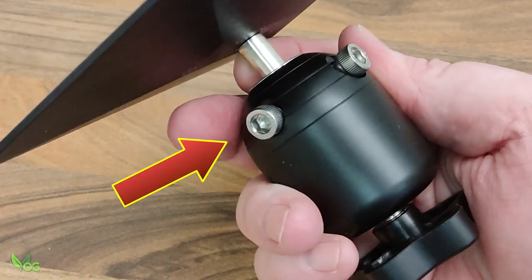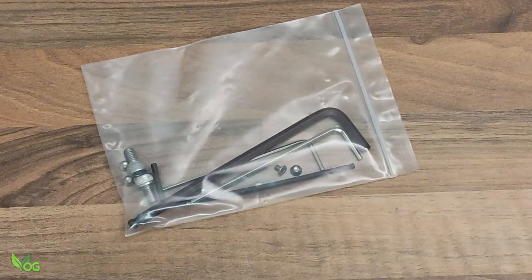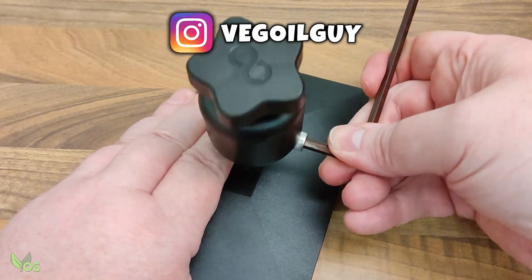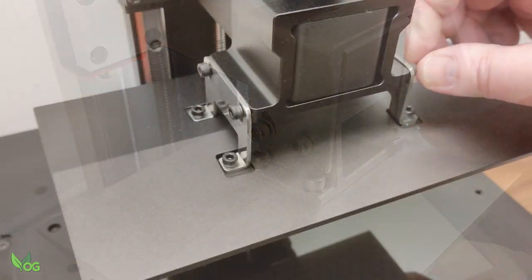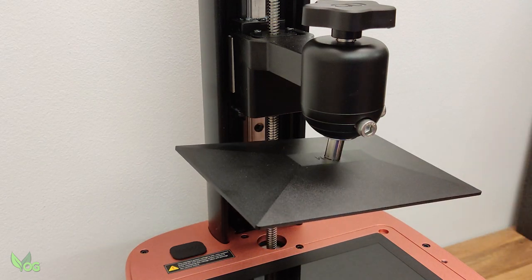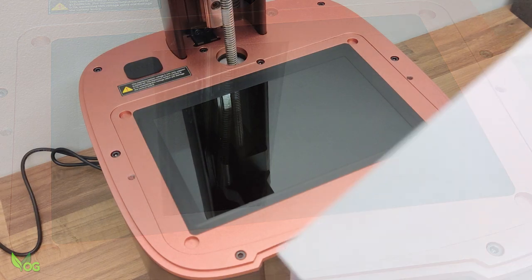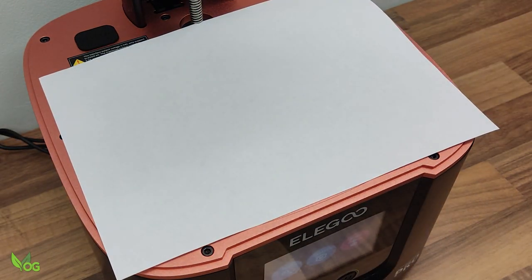To level it, the build plate first needs to be loosened. Inside the box of goodies you should find suitable Allen keys to do the job — keep these safe for future use. Do not remove the bolts; just loosen them sufficiently until the build plate can wobble around freely. A quarter turn is often enough. Different printers have different plates with different fixing systems, but the principle is the same: just loosen, don't remove. Reattach the build plate firmly to the Z-arm, making sure that it wobbles. Make sure the screen is free of any debris and never ever store tools on top of it — scratching this screen means an expensive repair. Place an ordinary piece of paper over the screen, ensuring it covers the whole screen.